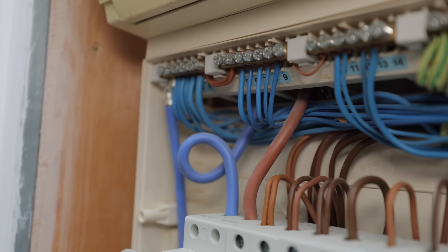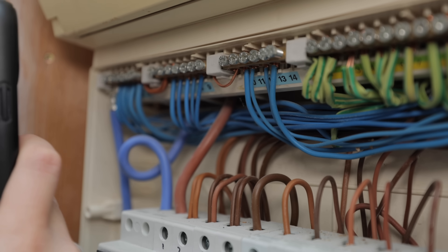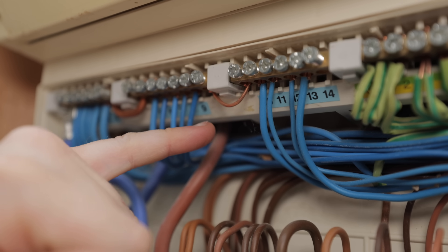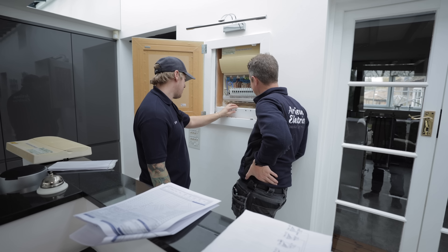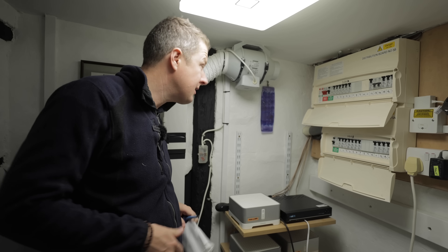One of the C2s I do agree with on the previous EICR is this: the use of a thin bit of bare copper to link the two neutral bars, which could potentially overheat and cause a fire. Why's it got holes in it — is that for ventilation? It's not even on. So it's coming up for brunch and Jordan's finally decided to get the tools out.